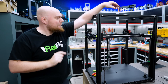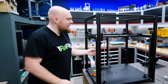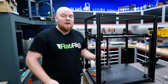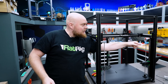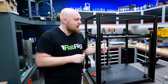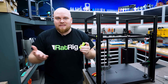That's going to be it for part two — the complete motion system is done and it is running super smooth. A few tips before we close off the video: this right here is the X-axis and it needs to hit both green bumpers at the same time. I had to loosen all the bolts we previously tightened — all these idlers and everything need to be loosened — which also means we needed to remove this green cover. So if you're going to do this, trying to get the gantry in line with no racking, I would suggest to remove this cover or just not install it in the first place.